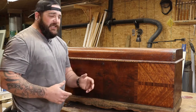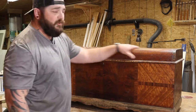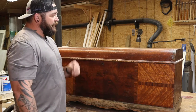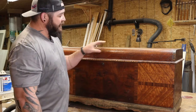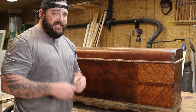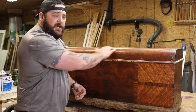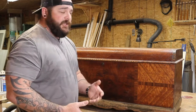It's a really nice chest, but we have to be really careful when we decide what we're going to do with restoring it. The first issue is that the veneer on these things is really thin. Veneer is inherently thin, so you don't want to go at this thing really aggressively with sandpaper as you could blow right through the veneer.